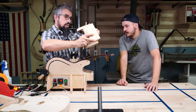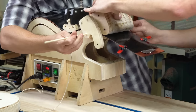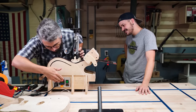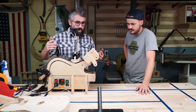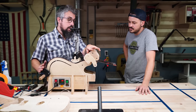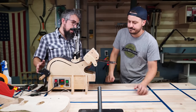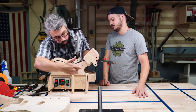Let me load this thing up. I've got this attached and the heat blanket back on. We really want to make sure we get this nice and hot because we're going to stress the crap out of this wood — this is a high-risk deal. That's why we loaded 10 pieces; I'm happy if we get five usable ones. The name of the game is patience. Last time we did this we broke quite a few — I think I just went a little too quick. We're going to let this get back up over 220 degrees, and then Matt is going to slowly start applying pressure, peeling this thing around. Once it's all the way around, we'll stick a dowel in and lock it in place.